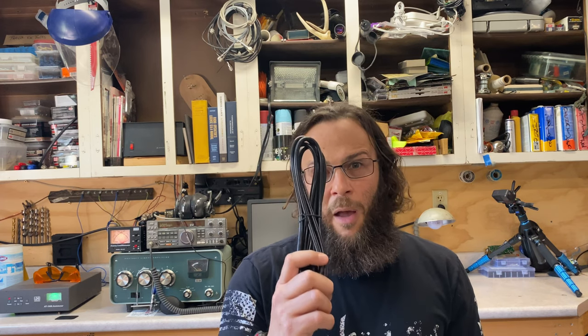So I'm going to have an output out of the primary radio going to the input of the secondary radio, and the secondary radio is going to be set to transmit that to the ground using VOX. And then on the ground, I'm going to use that to record the content of the audio from Parachute Mobile HF.